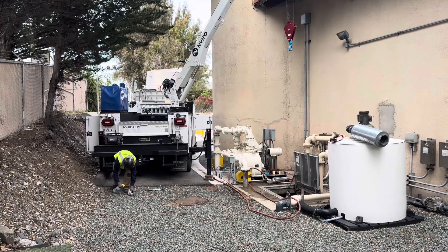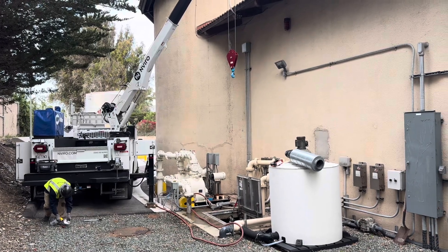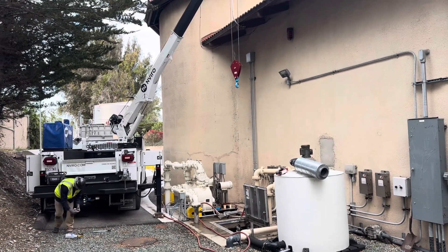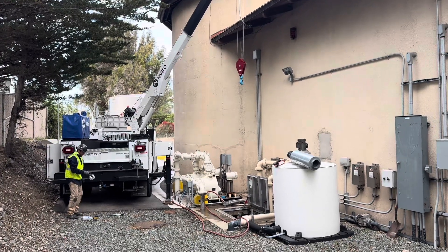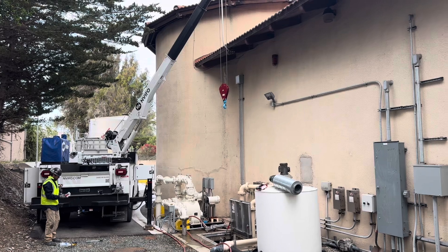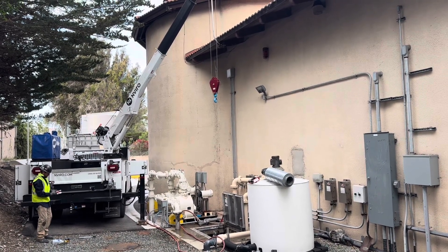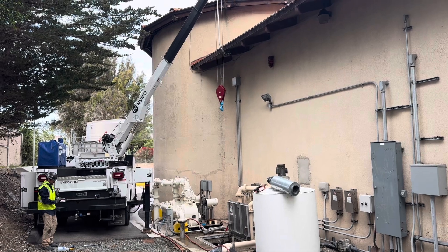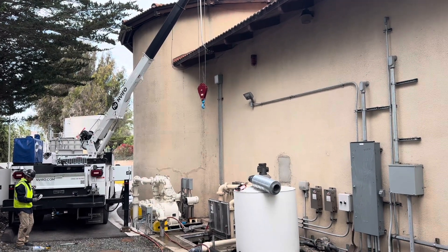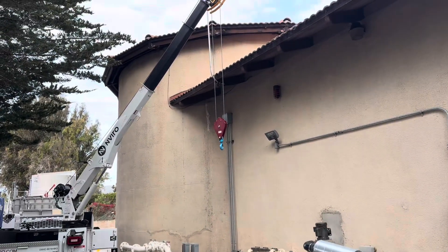You can actually see why he's cleaning his tools — we are done. In the following part of the video you're going to see us pull these pumps, clear them, and you're gonna see what ridiculous thing we pulled out of the pump that faulted. Then we went ahead and pulled the other pump and cleared it as well. It did have some rags in it. Then we're gonna talk about pumps and motors — the different kinds you'll run into in a wastewater plant and a couple other test items you need to know. So let's get these pumps pulled and get them cleared.